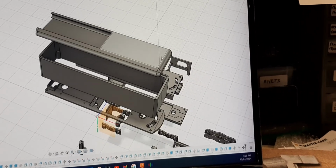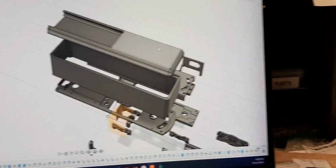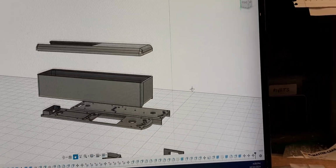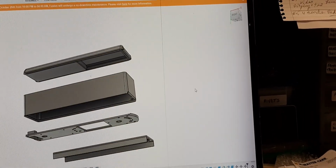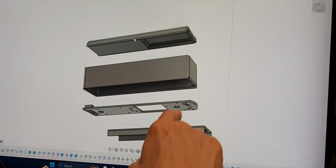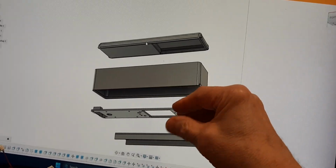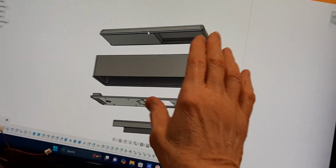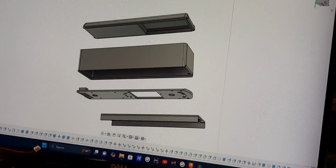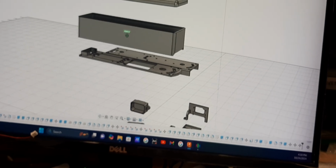I've raised the front half, the first 80 millimeters of the lid, to simulate the oil burner aspects, or we can replace that with the load of coal for the coal burner guys. But what I also have done is I've sucked out the bottom of it, so it gives me more room, because in that area I mount the volt regulators, and they're a little tall and they might need that extra room. So that's why I was kind of happy to be able to cut that in, and then just make that nose kind of a bull-nosed piece, so it's a little more rounded, and then this tilts back.